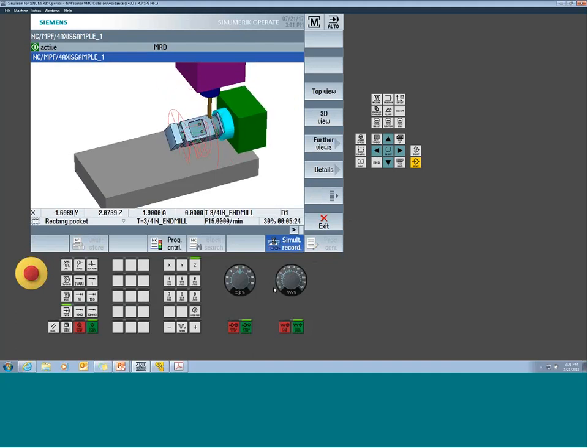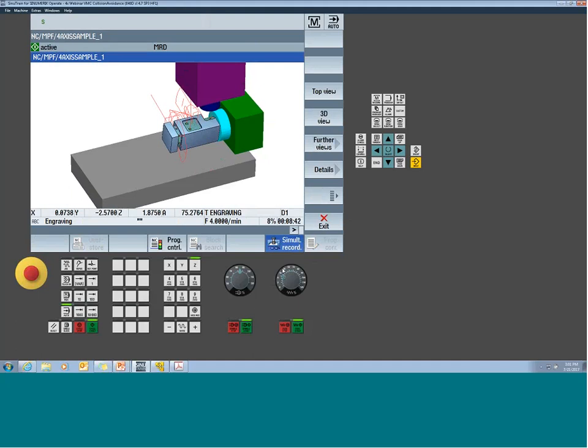There's our wrapping. So we can slow it down a little for you. There you get to see the machine, the overall. And this would be how I would expect the toolpath, obviously, to look. So in our simulation, we just let the tool kind of roll around the part. Obviously, when we get to the real machine kinematic, then it's going to match this motion. Finishing up our operation, it retracts. Now I haven't told it anything to do with the A, so that's why the A is still sitting at this skewed orientation position. Had I wanted to then stage it to some retract position, I can handle that as part of my retract strategy.